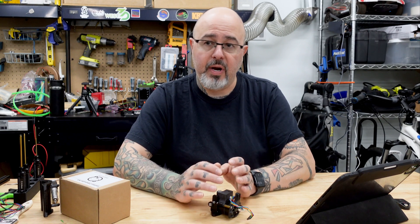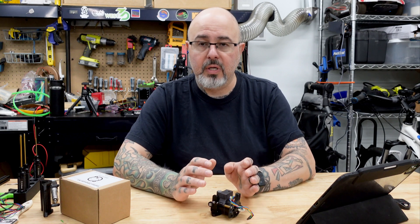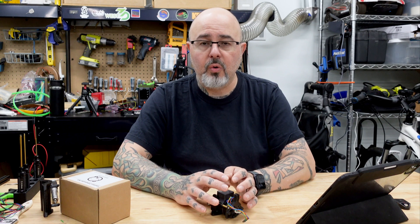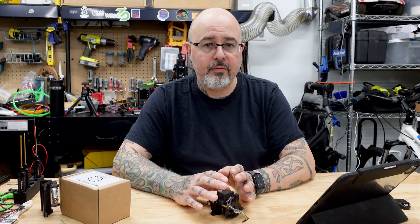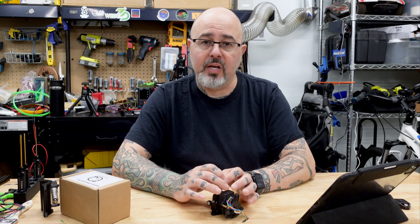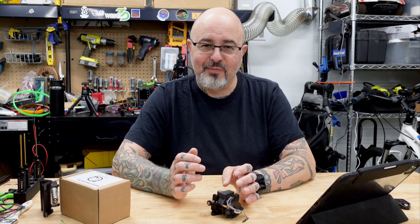The Orbiter 2 is a great extruder and I've been very happy with it, and it's done a great job until I started doing some work with TPU. It seems that there's a design issue with the Orbiter 2 where the filament path, especially at the top entry into the body, isn't fully constrained. And if for whatever reason the filament doesn't feed properly, it just starts feeding filament into the extruder body itself — it's not jamming, it's literally just squirreling filament into the Orbiter 2 until it gets full and stops and then just grinds.